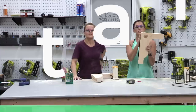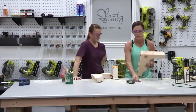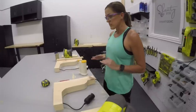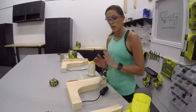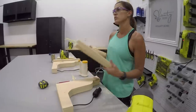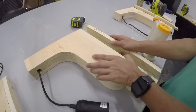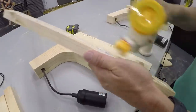Now we're going to add the trim. The trim is not only going to be used to make it pretty, but it's also going to make it sit against the wall really nicely and give a smooth channel on the backside for that cord. What's really cool about this project is that if you're building two corbels you can use one 1x12x8 and get every single piece of wood that you need. The weirdest part about this project is that you have to kind of work with it and build it with the cord still in there — it's kind of weird, but it all makes sense once it's done. We've cut all of these extra pieces to size from that 1x12x8. This piece is going to go on the back — this is the cleat and it's going to attach to the wall and give us something to attach the corbel to the wall with. We're not attaching that right now, but we do need it while we're attaching the 1x2 trim, which is cut to the same length as the length of the corbel.